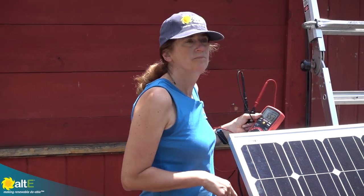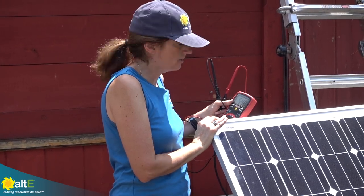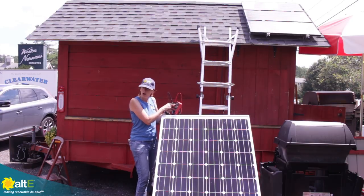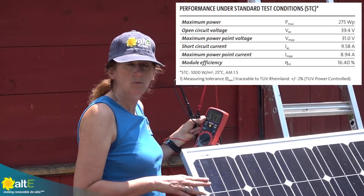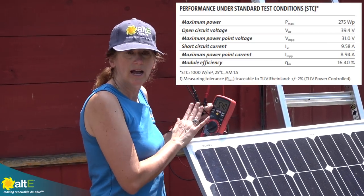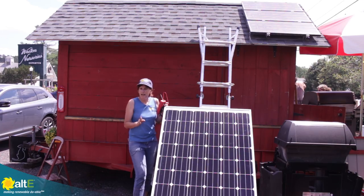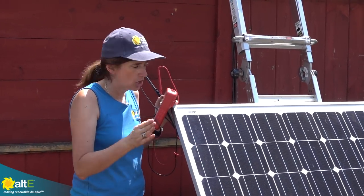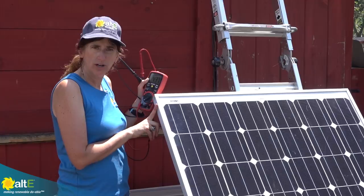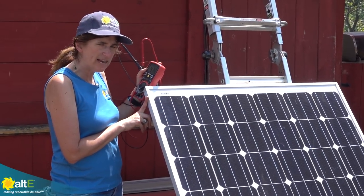We are replacing those three small 12-volt panels with one big 20-volt panel. I'm measuring just right across the plus and minus of the 20-volt panel. This is a 275-watt Solar World panel. The short-circuit current — which is what you measure when you're disconnected to anything but the meter — is about 9.5 amps. Right now it's probably about noon and I'm facing west, so I'm seeing about 4.3 amps.